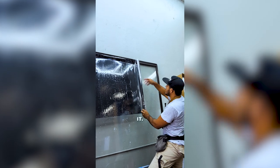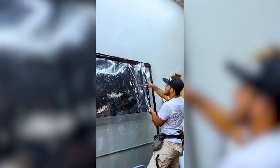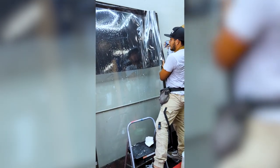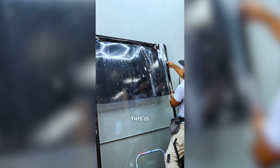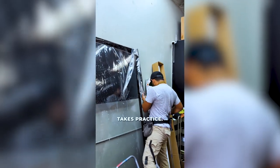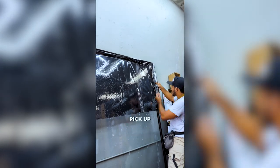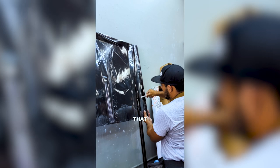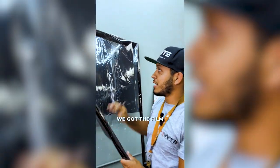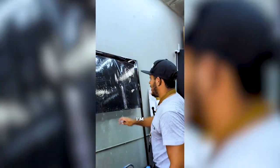As I go I keep it wet, opening it up and spraying. This side-to-side technique is a little awkward — normally I do this window up and down — but the sideways technique is used when the window is really big and we have to seam it, stacking one piece on the bottom of another. Since I didn't pre-cut my film I'm just working out of the scrap, so now I cut off whatever I have over.